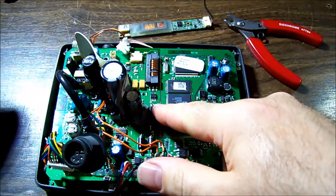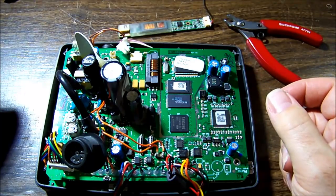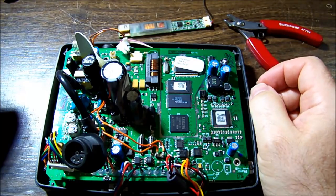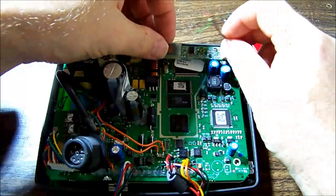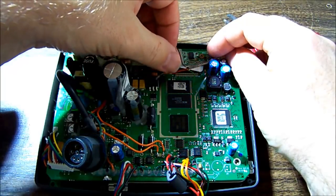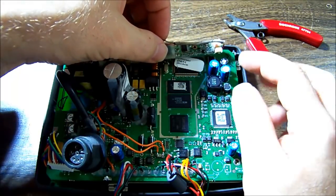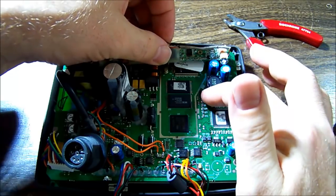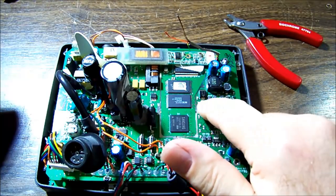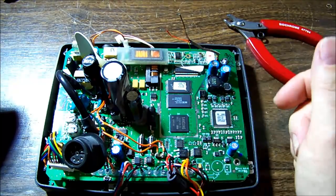But now I need to find a power source. We know our 12-volt source comes in through this inductor, so I'm going to tap off that inductor. But I also need a 0 to 5 volt, it said, for the activate on the chip enable. Now I've got this much cable left. I'm going to have to attach some to the power cables to extend them over, unfortunately, unless there's 12 volts on here somewhere, I will double check that, because if I could take it all off from over here, because these caps look like 4.7 volts, so I'm picking this as a 3 volt line, and I'll be able to tap off that too for the backlight enable.